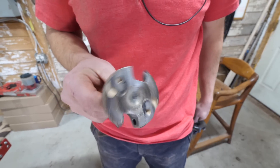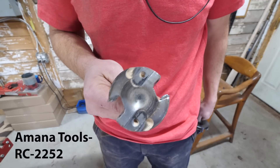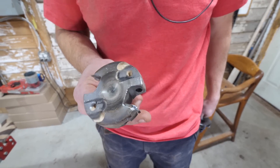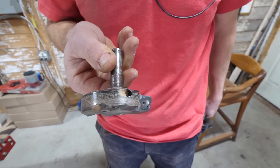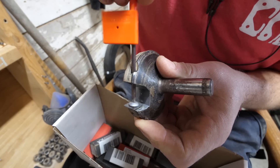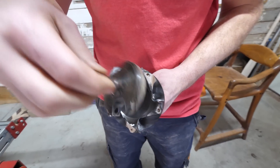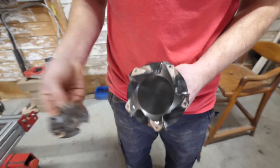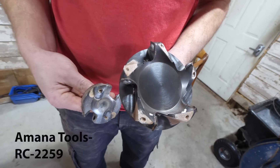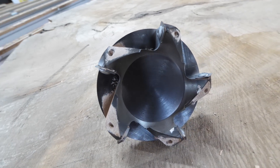This is the cutter head we typically use — the RC2252 from Amana Tools. We don't use the two bottom cutters, only the side cutters. We just noticed our side cutters pretty much shattered, so it has a carbide insert we're going to change out right now and put fresh inserts on. The other bit we use is this bad boy — look at the size difference. This is an Amana Tool RC2259 and it has five inserts that actually cut on a chamfer with a little flat bottom on them.